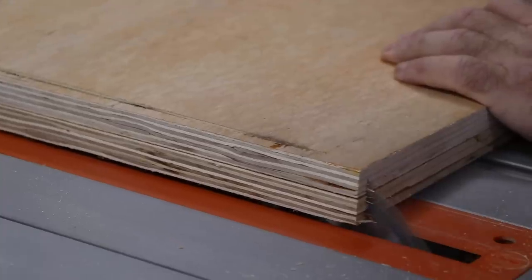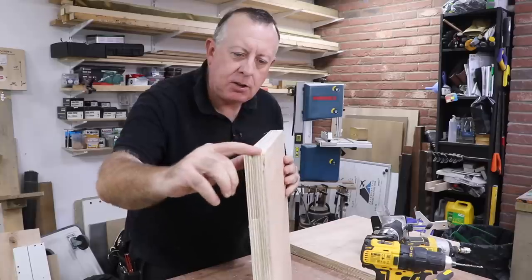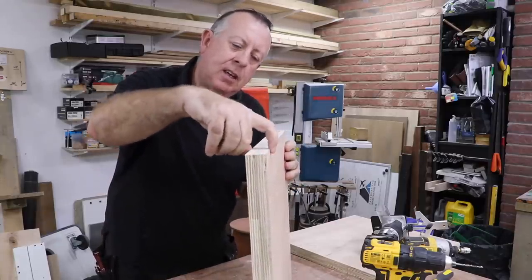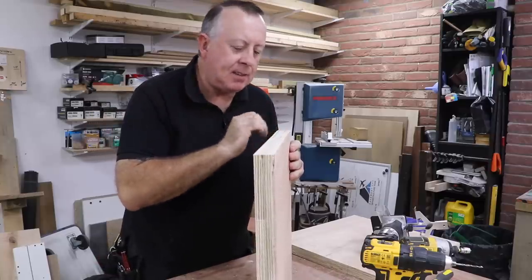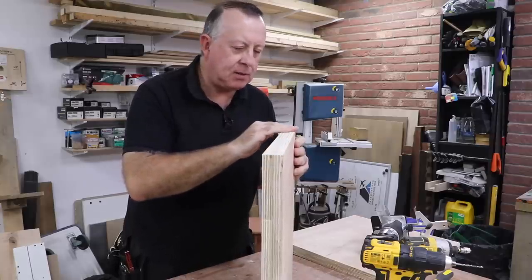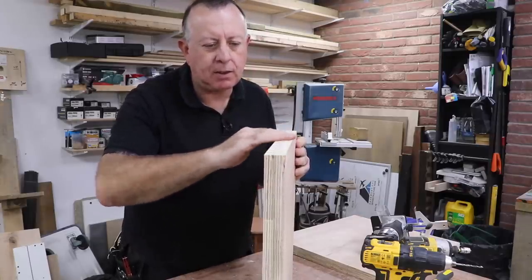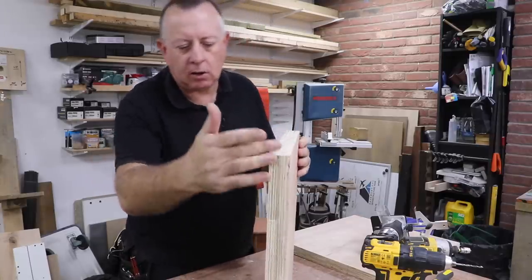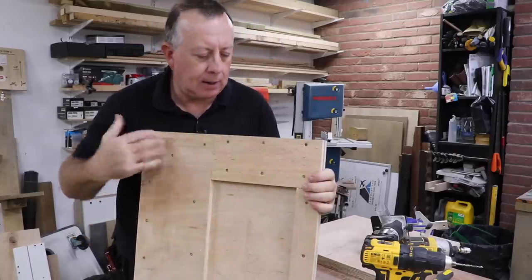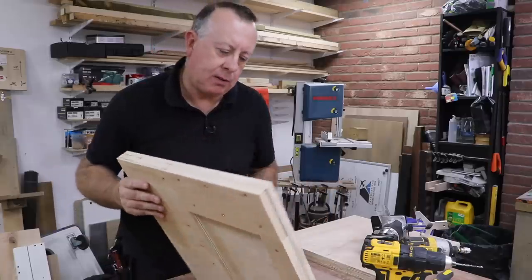So that is very satisfying, cutting through two thicknesses of ply that have been glued and screwed together. So you cut through 36mm, which means that however well you line them up to start with doesn't actually matter, because now I've got a nice perfect 90 degree cut on two sides, and those are the two sides that you're ever going to see. Underneath is a little bit hollow, but that's where my wires are going to go.